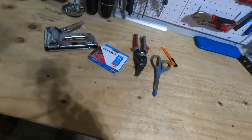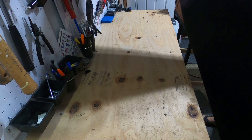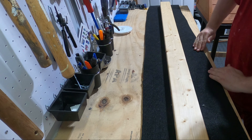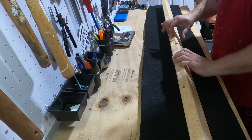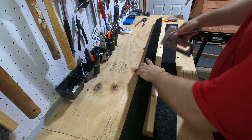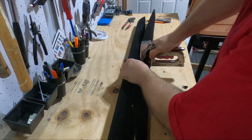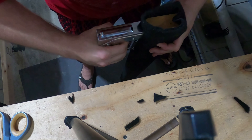Once you have your lumber cut and sealed, you want to get your tools together for the carpet wrapping. Make sure that the staples you get are going to be stainless steel — you don't want them to rust out and have all your carpet fall right off. So the first thing I want to do is cut down some carpet to size. This needs to be 11 inches wide. So now what we're going to do is center the wood on the piece of carpet, wrap each side over, staple it down the middle, and then work on our corners. You can join your seam either on the back, top, or bottom.